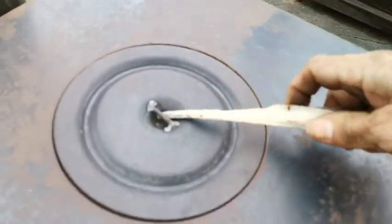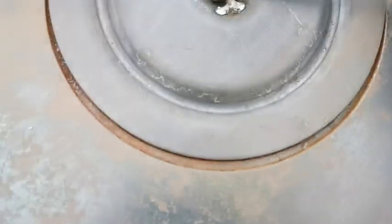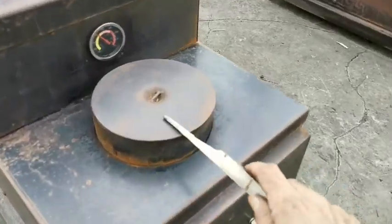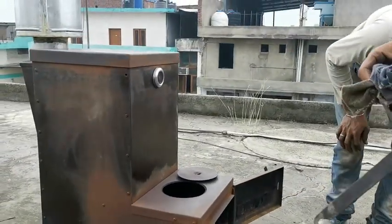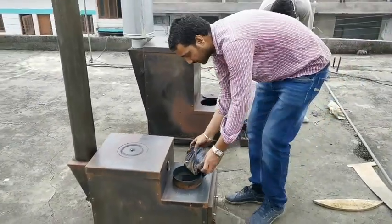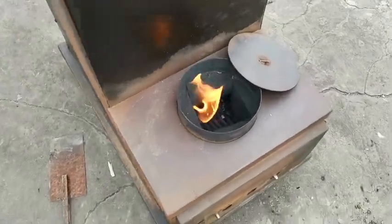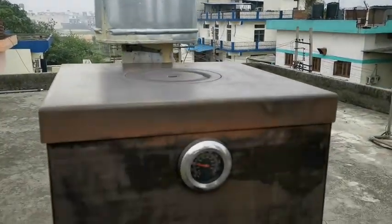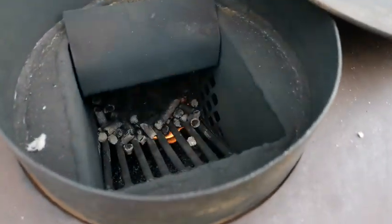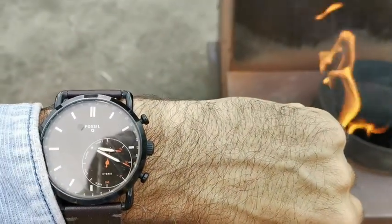We're 45 minutes in and we've still got just a few pellets left, clearly still burning but the flame is not very strong. So we're going to move the pellet feeder from eco1 across to eco3 and see if the extra suction on the eco3 is enough to get it to burn properly. We've moved the pellet feeder across to eco3 — eco1 had a good 45 minutes of burning and we're checking the temperature gauge on the last remnants of the original one-kilo test.